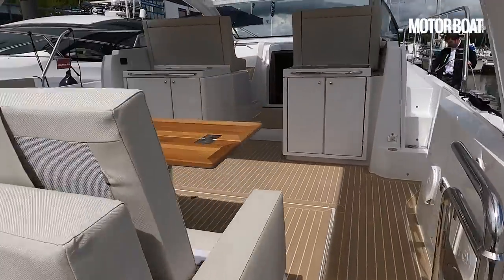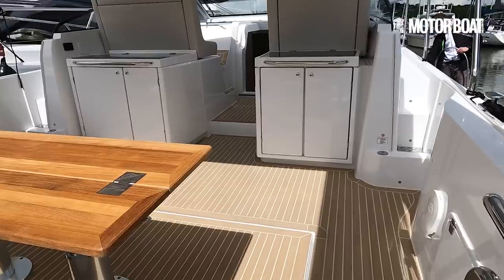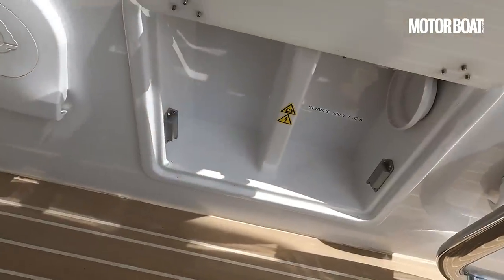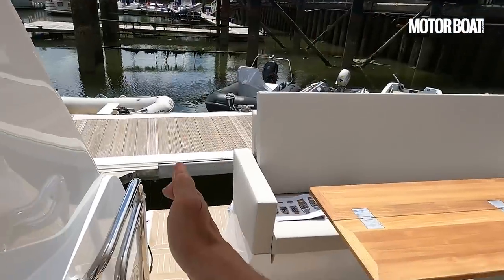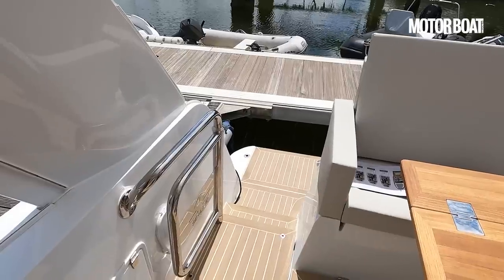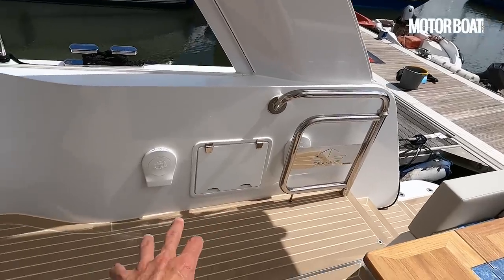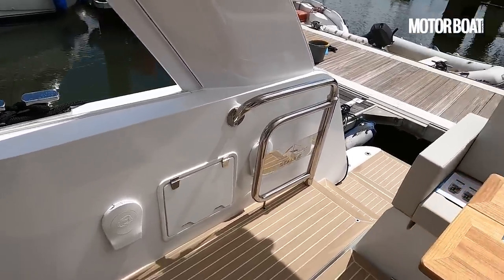As you step forward into this big cockpit, space is a major plus point. On the way in we have the transom shower, which makes good sense. What makes less sense is the fact that we have the shore power on the starboard side, because this is an asymmetrical layout — an L-shaped seating area. The only point of access to this cockpit is on the starboard side, so why have your shore power over here when the cable will get in the way and create a trip hazard at your entry point? The reason, according to the guys, is that all the wiring looms are on the starboard side. Not perfect, but manageable.